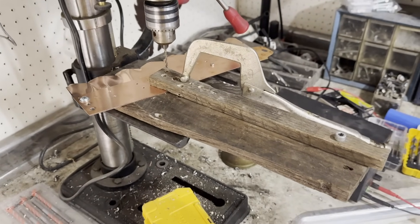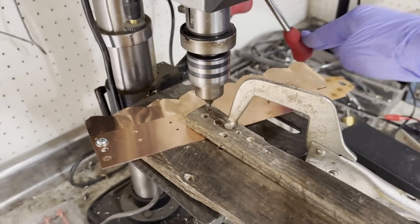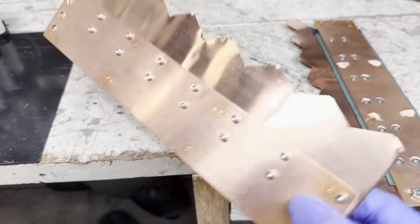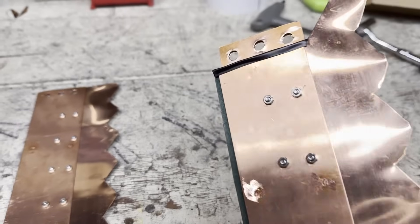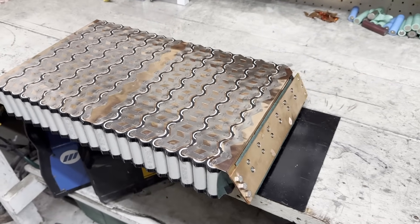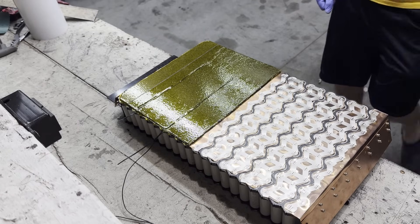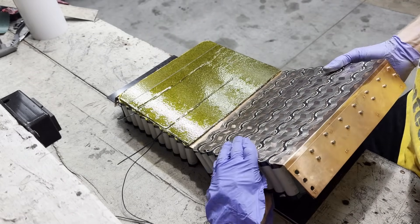When it comes to drilling through soft, thin materials like copper sheets, it helps to clamp them between two pieces of wood. Here's how the end pieces look all bolted together — I think they turned out pretty nice. Of course, I'm using threadlocker on all the bolts in this battery because I can't just reach in there and tighten them up. To separate the two halves, I cut out a piece of plastic and then put the temperature sensors inside it. Now it's time to fold it up — I'm trying my best to not put a super sharp bend in the copper, because then it may break later.